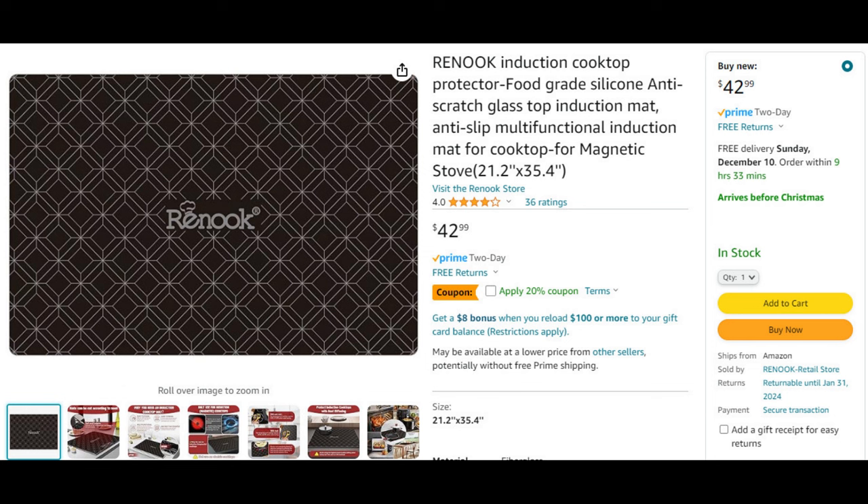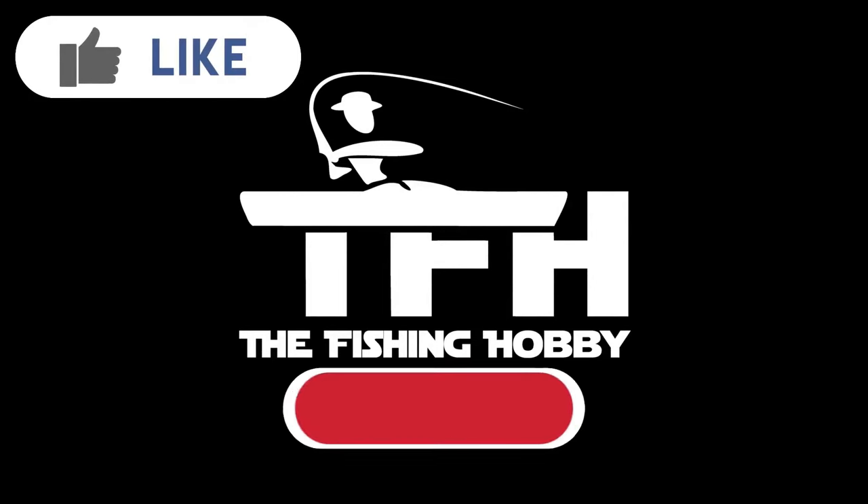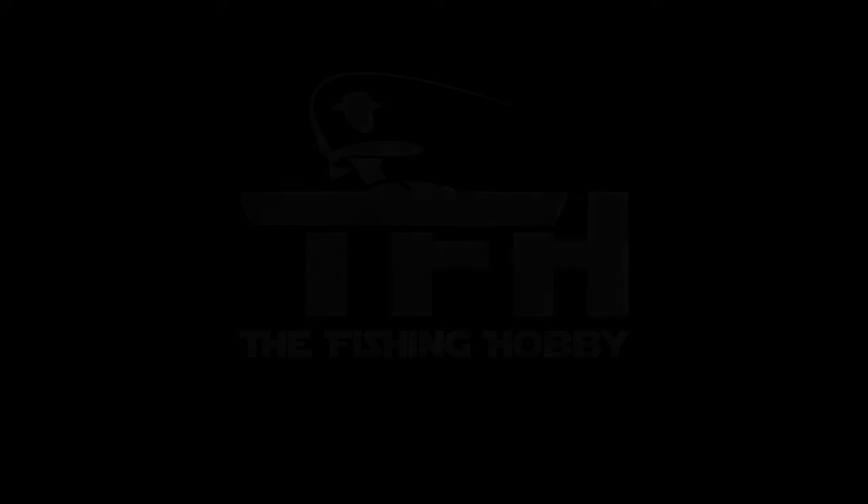So that's something you might want to try if you're using glass or mirrors to print on and they have a little bit of weight to them. I found a really big silicone sheet that was a stovetop cover, cut it down to size, and one sheet was enough to do all six of my Ender 3s. I have a CR10 I haven't put a sheet under yet because I need more material, but I've been really happy with this. I started on one printer, added it to another, and now all six of my Ender 3s are running these sheets with no issues. I'm not printing over 100mm/s — if you are, it might be an issue, but that's the tip I promised about possibly getting rid of bed clips if you're using something with a little weight to it.